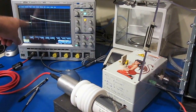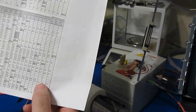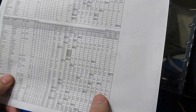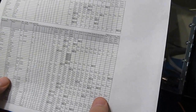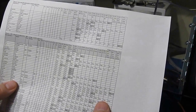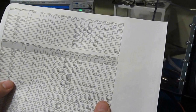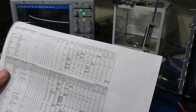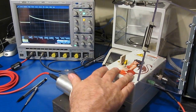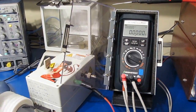The scope is now set for 5 kV per division - you can see we're up two divisions here, or roughly ten thousand volts peak. There aren't very many meters I've tested at this level. One was the modified UT61E, another was my modified UT181A, the Hioki DT4252 passed this level, the Fluke 115 passed, the Fluke 101 passed, the Fluke 17B Plus passed. Unfortunately when I was testing my Brymen BM869S and the Radio Shack, I didn't actually have a way to strap this generator properly, so I don't exactly know where that BM869 fails.